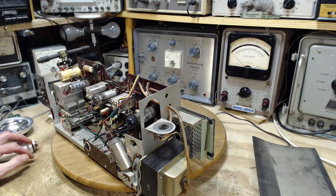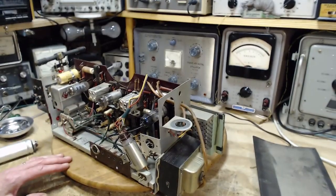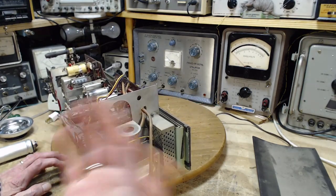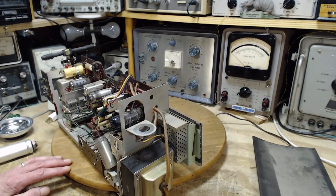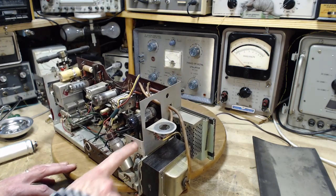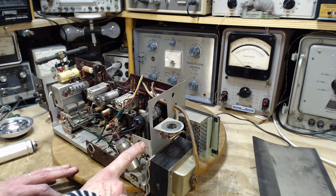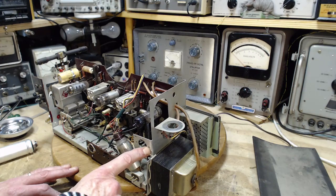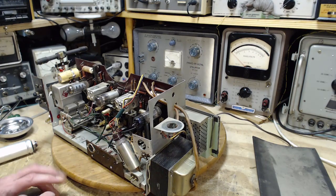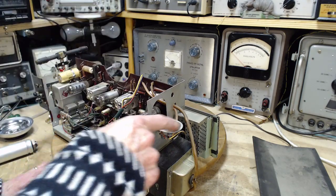And the last thing I've got to sort out here is I need a ground terminal. I need a good... Nothing. Here. What's this? There's nothing in there. I'm going to put a self-tapping screw in here. It's not too good to do a mechanical connection on an electronic part like that, but that's how it was done up here.